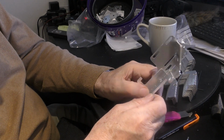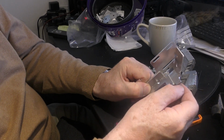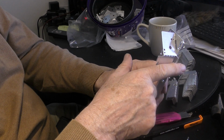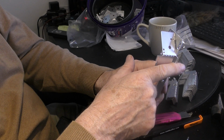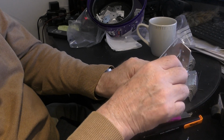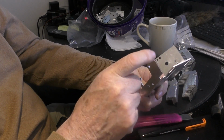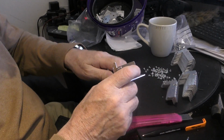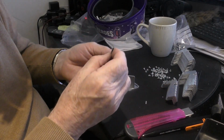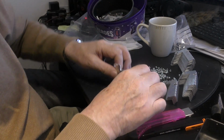Now there are lots of extra pieces on here which are not required for the K40. You'll find that there's a bent section here which is not bent at the moment that matches up with this piece here. This is for locating it on other brackets for other types of machines. So this is developed into quite a universal piece of kit, and that's what these holes are here for. They're for fixing onto yet another type of bracket. So we shan't be changing away from this universal head. We've got two tapped holes in the end here, remember, which are for the mirror adjusting screws. We've got some M3 grub screws, 10mm long, which are going to be used to adjust the mirror. So we're just going to pop those in there and take them through about 1 or 2mm projecting through.